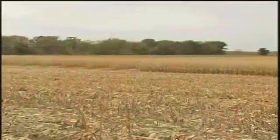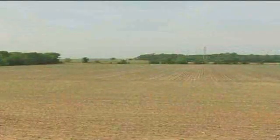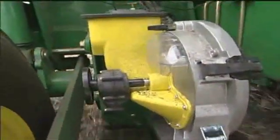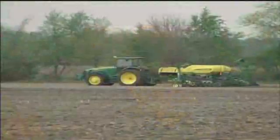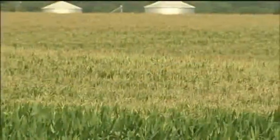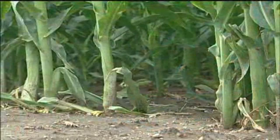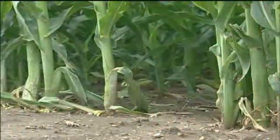With more corn on corn ground and more no-till, strip-till, and minimum-till, corn fields have become rougher in recent years. Planting fast on rough fields can reduce planter accuracy. Today's genetically modified seeds are often less uniform in size and shape, and seed treatments can make it more difficult to select and drop a single seed. This has meant cell-type seed disks, traditionally used for planting corn, do not always provide the best seed singulation.